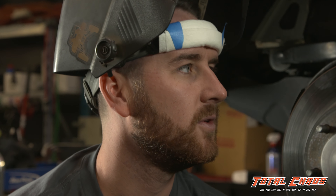With the body mount plate tacked in place, we're now going to weld it on. Since it's such thin material, we prefer stitch welding, but it's up to you which method you prefer.